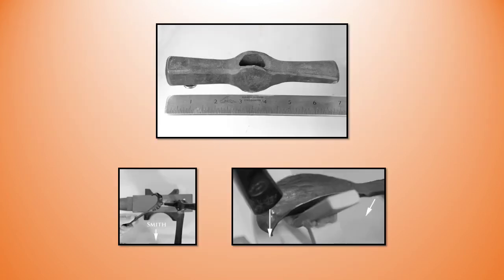You're going to want a leafing hammer. Mine is made from one-inch square bar mild steel, which I then case-harden, and that's fine. I've had plenty of these hammers in student hands for a couple of decades and they don't wear, so mild steel is just fine. These are not forging hammers — they're basically a repousse hammer, so mild steel works fine. I like about a three-inch length on either side of the eye to the working surface, and I find that adequate. It gives me enough clearance so I'm not banging the handle into the edge of the leaf or my knuckles into the edge of the leaf.